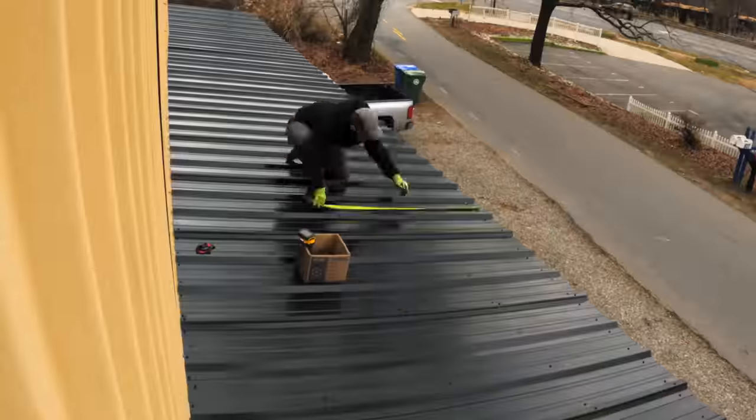On the other end of the flashing, I cut away about six inches of the hem so I could tuck this piece into the next piece in line, similar to how I did with the eave drip edge. I got up on the roof to get the flashing installed — though my GoPro decided to die right then, so I don't have footage of the first piece going in. The basic process was to add a strip of butyl tape and foam closures an inch back from the edge of the end wall trim, then tuck the trim up under the siding panels. After getting the first piece installed, I added the rest of the butyl tape and foam closures before moving on.